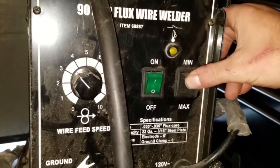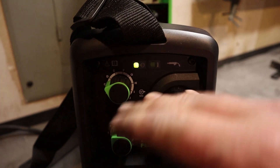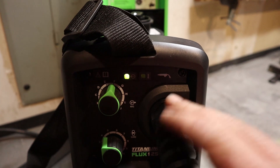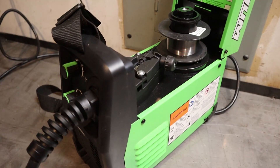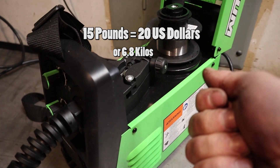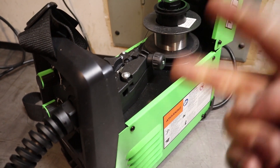Instead of just having a min/max like you'd have on one of the cheaper welders, you have a scale. Because this is an inverter, it's actually able to vary the amperage going out to the gun, so you have a lot of options. If your welds don't look quite right, you're able to change them. I love how small and lightweight this welder is — it's only about 15 pounds. I have a 110 plug-in welder at work that's over 80 pounds, so I love this.